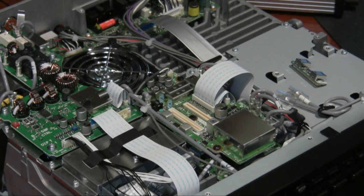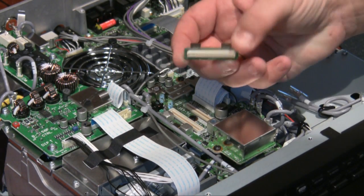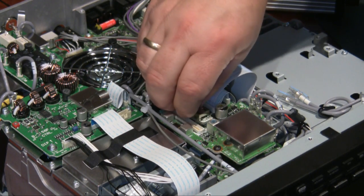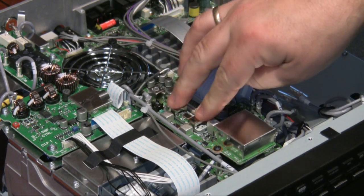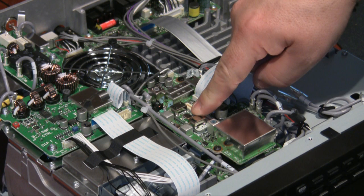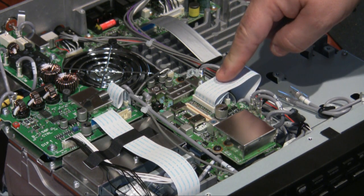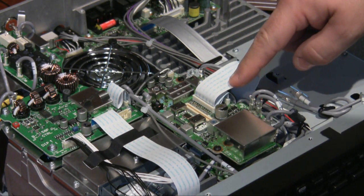I've put the camera on the tripod. Here's the filter with the connector, and as you can see the connector matches up to this one here. All we do to install the filter is push it into place — and that's the filter in. This is the 6kHz one, and the one that fits in the other slot is the 3kHz one which I'm still waiting for in the post. When it arrives I'll put both filters in.